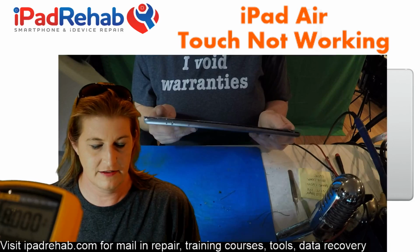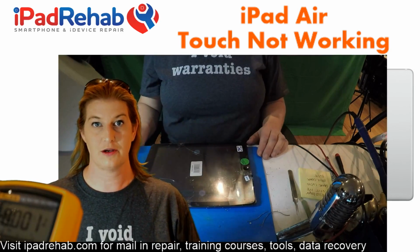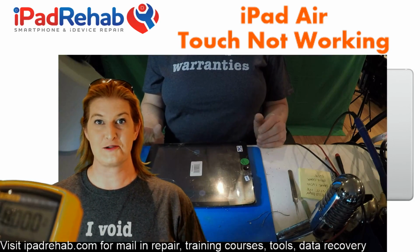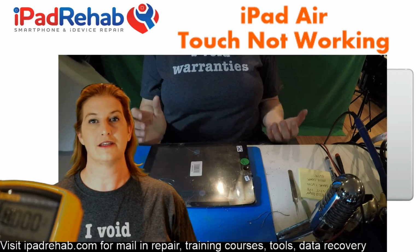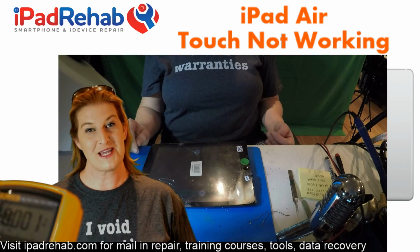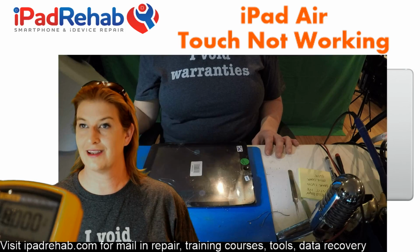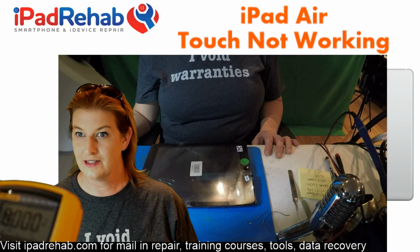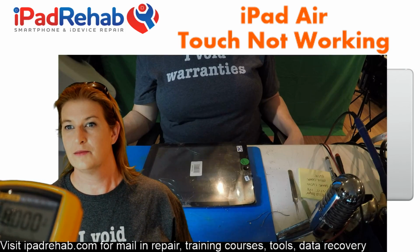All right, so with this device, we've just done one step during the troubleshooting path, which is start with power and then go to data. So power, as far as we know, our first question: are these chips getting power? We have checked out one rail, PP1V8, whatever it is when it goes over to the Cumulus. So just to wrap this up and put a bow on it.